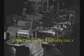We are now in the wire drawing shop, where the quarter-inch rod, in being drawn down, is passed in succession through 9 dies drilled with trumpet-shaped holes, each hole effecting a progressive reduction in the diameter of the wire, until it reaches the diameter of 0.062 of an inch. This type of wire is used in cables, for winding motors and other purposes where appreciable current is carried.